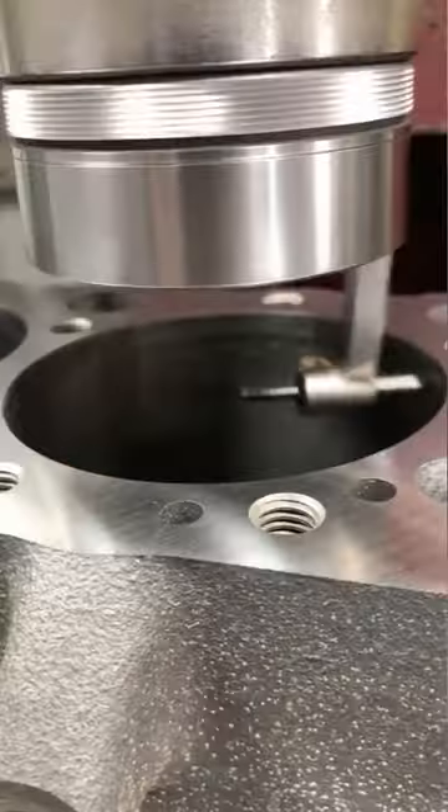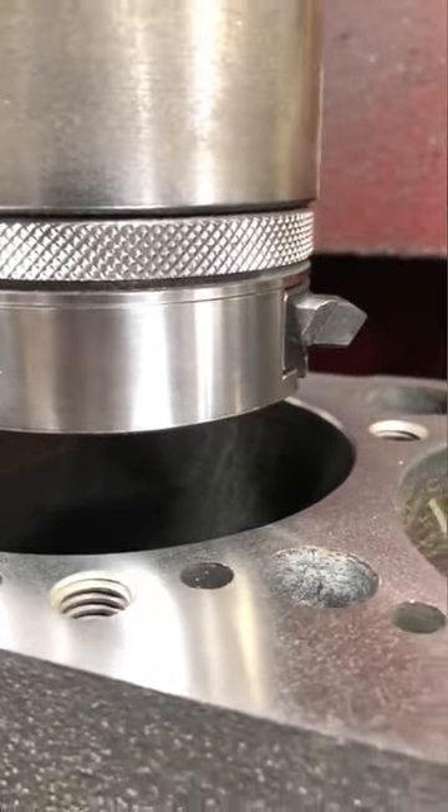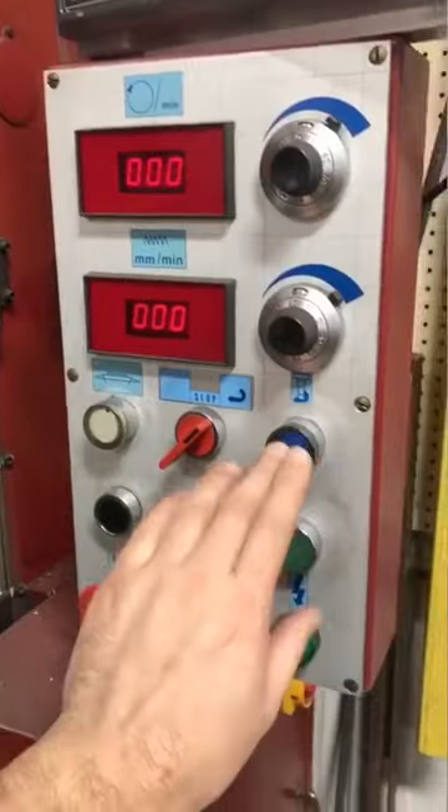Eight thou later was shiny, smooth, and flat. Next, I center up on the first cylinder and chamfer the top edge with an angled cutter. Next, I set my cutter for the bore size and set the spindle feed stop.